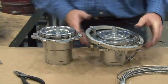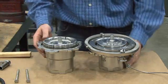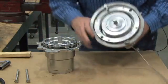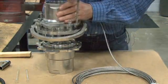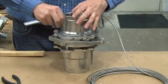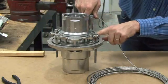Now we are ready to remount the two halves of the unit together. For larger sizes, 3 inches and up, find the long mounting screws provided with your SZ coupler — these are used only for the purposes of reassembly. For smaller sizes, the two halves can be drawn together by hand. Align the two halves, including the poppet and the guide bolt shown here, and make sure that it goes into the guide bolt hole on the other half. Once you are aligned, press down firmly and thread in the mounting screws, one on either side, to pull the two halves securely together. Once joined, evenly release the tension on the assembly screws around the diameter of the coupler to let the slide ring come back down. This engages the slide ring over the four holding sections, holding the coupler securely together.